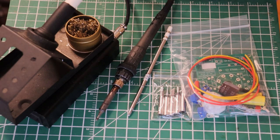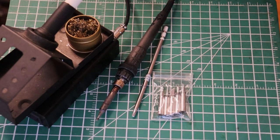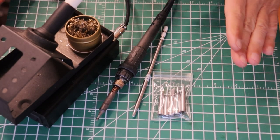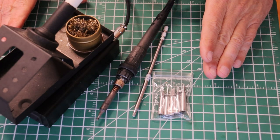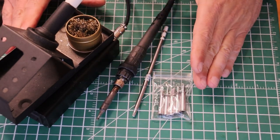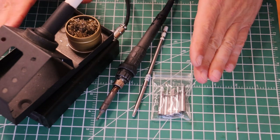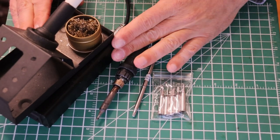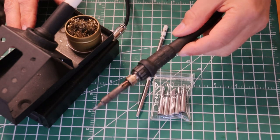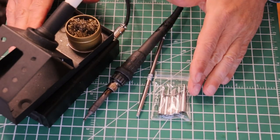Methodology is basically time and temperature, and I'll show you all of that through real examples live. Safety is absolutely critical in any of your endeavors. You want to really look after, in particular, the burn and fire hazard of your soldering iron. I highly recommend you get a soldering station that has an auto-off. When the soldering iron hasn't been moving around for a little while, the sensor will simply turn the iron off.